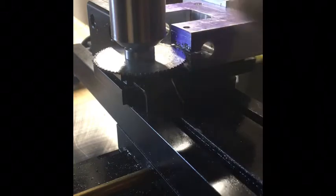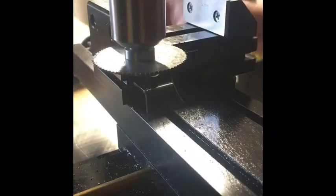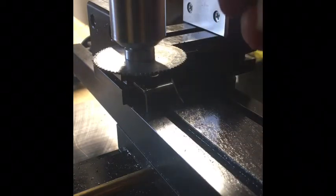The lesson I learned here is that lubrication is important even with aluminum - it was causing the motor to stall out a little bit. I think it was heating up fast and causing extra load for the motor, and these motors can't really deal with too much. Now that I have the right recipe it seemed to go pretty well. I can take this side out - this side is done. Then I just have to flip it around and do the other leg. You can see the saw cut, and I have to clean it off and deburr it before putting it on the other side.